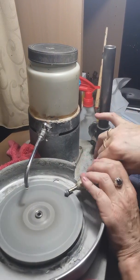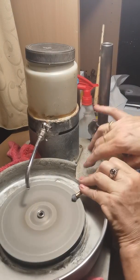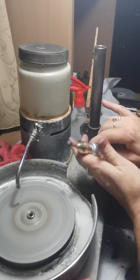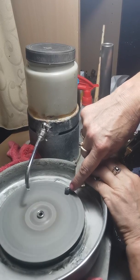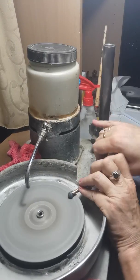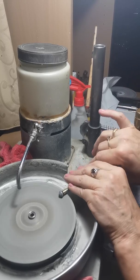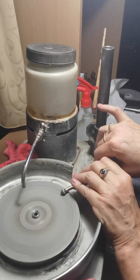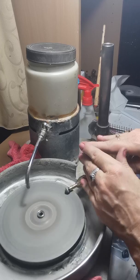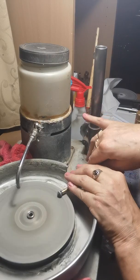We want even pressure and use both hands to make sure we're getting a nice round. Keeping an eye on what's happening — here I've got a pretty nice chunky girdle, and there's a bit of a divot here. At this stage you're really cutting by ear, listening to when it's hitting and when it's missing. Where it's hitting is the widest part of the girdle circumference, so that area needs to grind away a bit more.